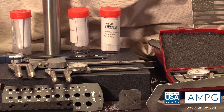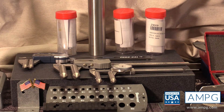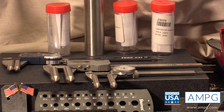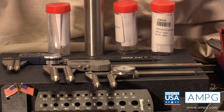In general terms, these tools and accessories are accurate to within two thousandths, possibly three thousandths — it depends on your technique. A dial or digital caliper, based on resolution, is accurate to plus or minus a thou, so in theory it could be as far off as two and a half to three thousandths. But once your technique is developed, you'll find that you can get some very accurate measurements.